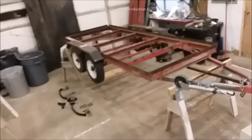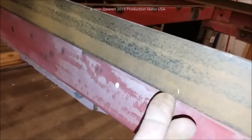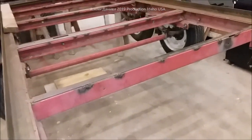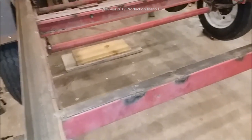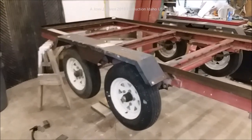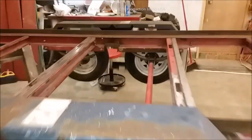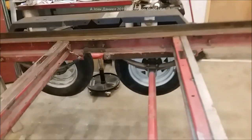There is the Harbor Freight double axle — 10 foot 2 inches long and 50 inches wide. You'll see it's a 48-inch frame with one inch extended on each side. We went through here to beef it all up. This is my 10-year-old's welding job up here, and he's in here grinding it down. This is his trailer — I don't own this trailer, my now 12-year-old does. We are now putting that set of genuine equalizer springs on it to beef it up, because everybody tells me the Harbor Freight springs will break right there at the slipper joint.